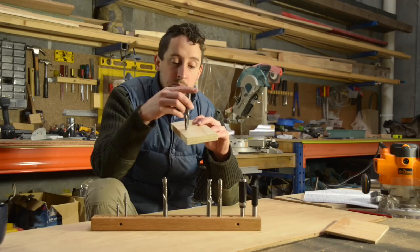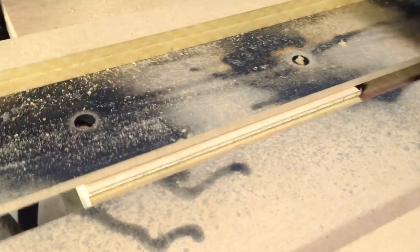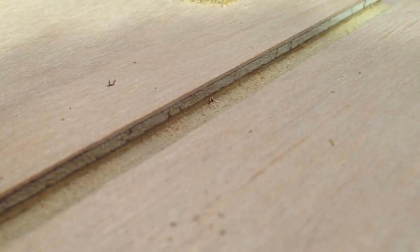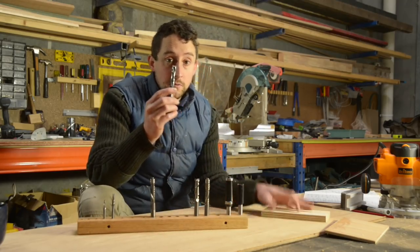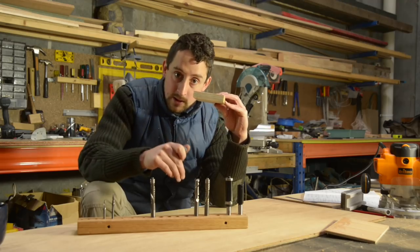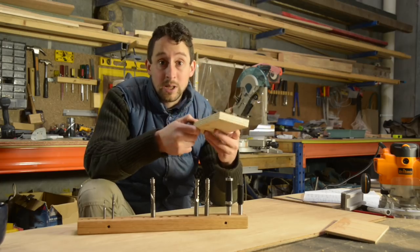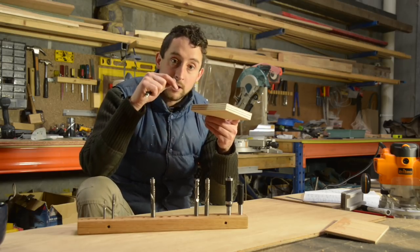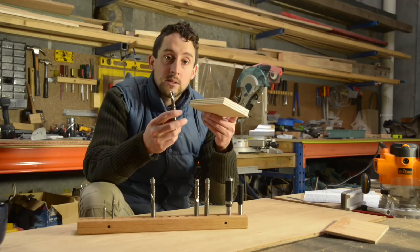What you have to keep in mind is that because these are pushing the timber downwards — which is what creates that really nice smooth edge — it's also pushing the chips down into the trough. So you can't do really nice deep cuts like you can with a spiral up cut bit. With a down cut bit you're doing multiple passes, getting a really nice crystal-clear edge on the top, but you are pushing those chips down into the trough, which just means you're going to have to slow down a little bit. You can use these down cut bits for full-depth cuts through timber because the chips are going to shoot away from the motor rather than back up. You can also use them to do really nice clean edge cuts and edge trims along timber, melamine, and ply. If you're using a handheld router, it's going to push chips down toward the floor; in a table router the chips are going to be going upwards, so you might want a guard in place.